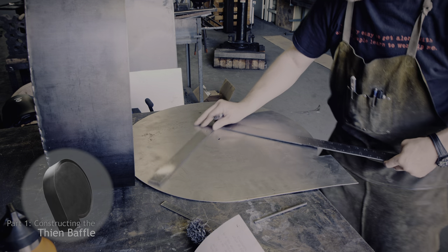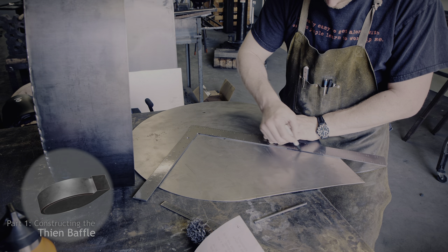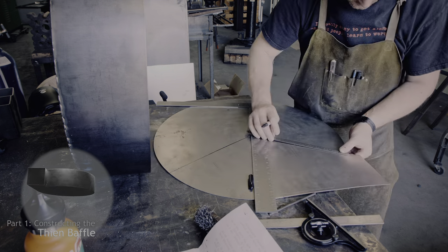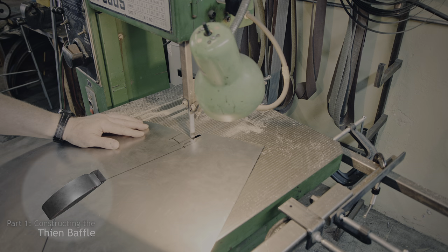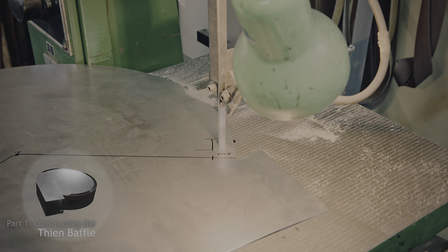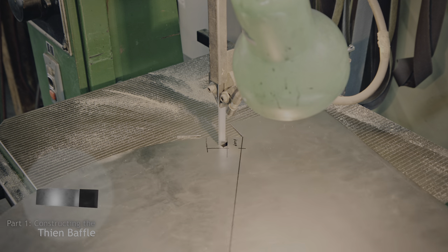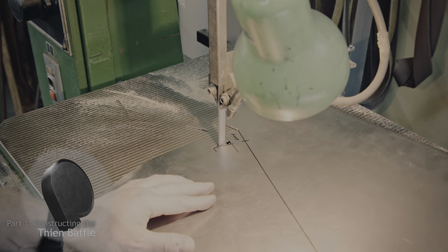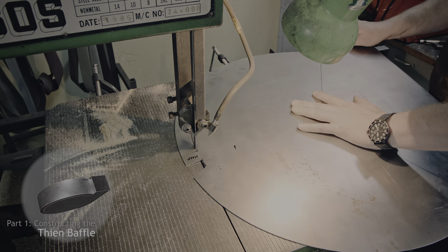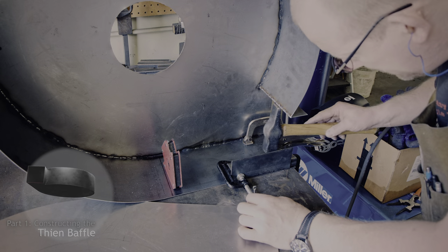The cutout is a 240 degree arc that stops at the inlet. Since I want to use my circle cutting jig on the bandsaw again, I need to figure out where the cuts need to be placed and where I need to make space for the bandsaw blade. Creating the opening for the blade requires many small cuts due to the limited turning radius of the blade I have installed. Once the opening is there, cutting the remainder of the circle is fortunately quite easy. At the moment, I am keeping a small tab to help with welding the bottom to the rest of the baffle.